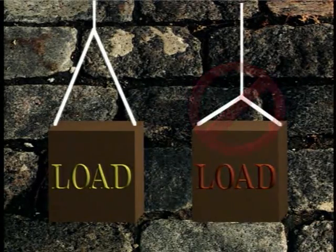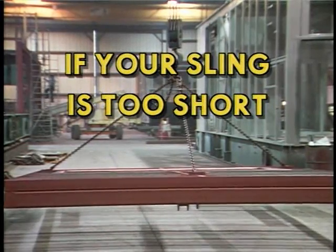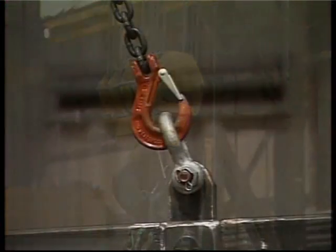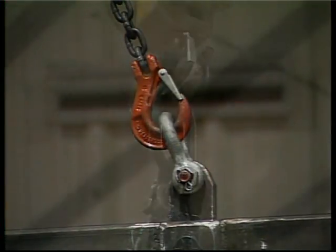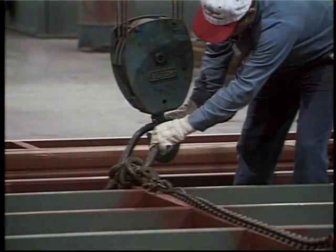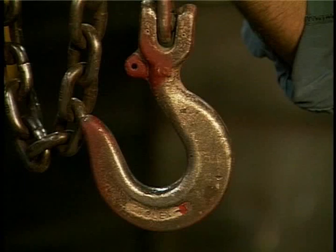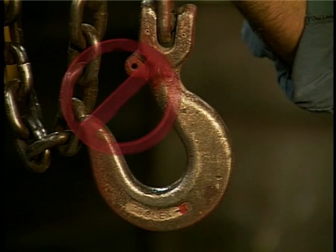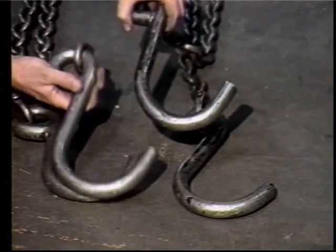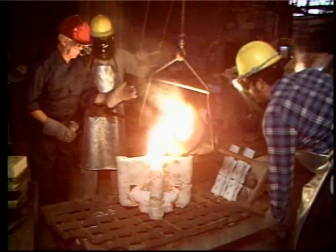This illustrates very clearly that it's easy to overload your sling even though you don't have a maximum capacity load. That's why you have to make sure your sling angles are as close to the vertical as possible. If you're creating unsafe sling angles because your sling is too short, get another sling. Part of your equipment includes hooks. There are two common types. One type must have a safety latch to keep your sling from slipping off — all crane hooks must have safety latches. If the latch is broken or bent, have it repaired or replaced. Another hook type doesn't require a safety latch because it connects directly to the material being elevated; these are generally used in foundries or heavy manufacturing.